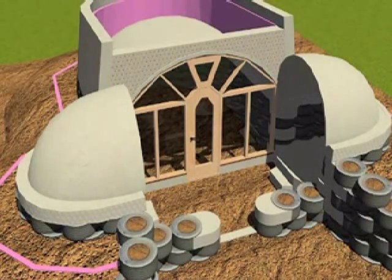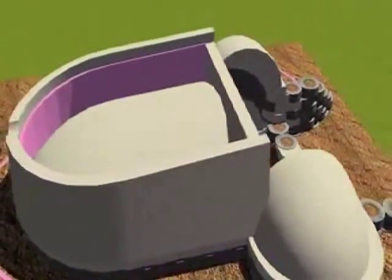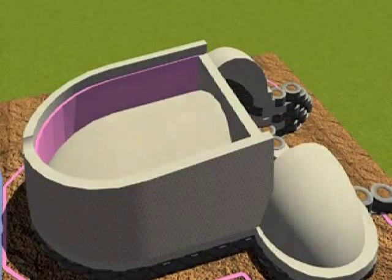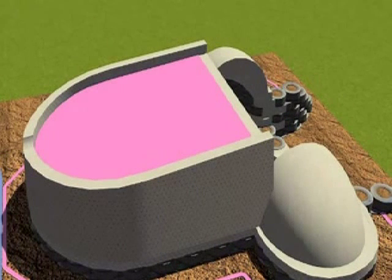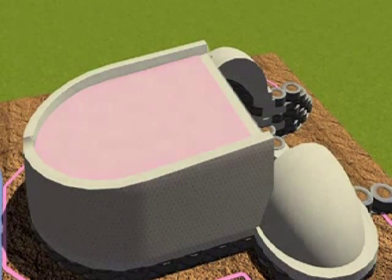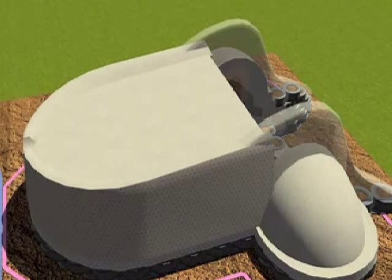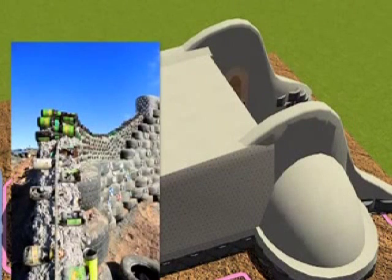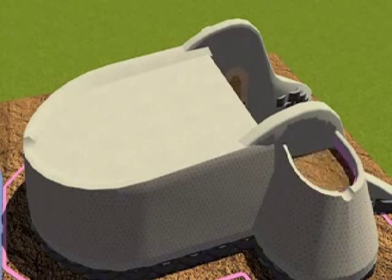A wrap of insulation and then filled with dirt gives a very simple thermal roof detail that will allow us a plane of earth on which to pour a slab — a basic slab roof. We usually put insulation down depending on the climate before pouring the slab. The slab will then drain into the cisterns. This is using bottle or can masonry to form up for the dirt, and we usually put a vapor barrier in right after the insulation, under the slab.